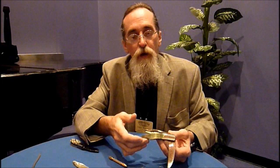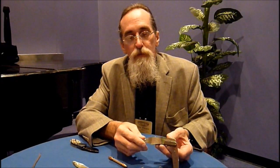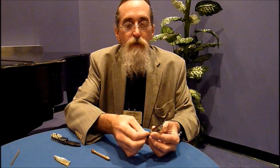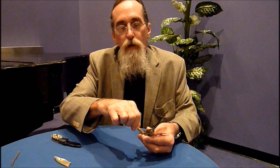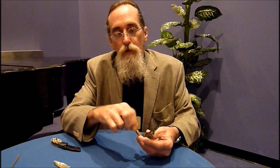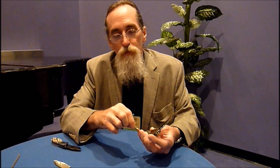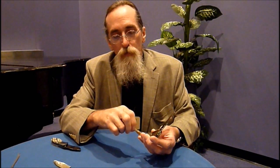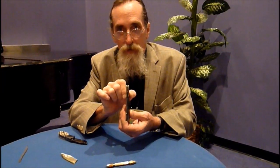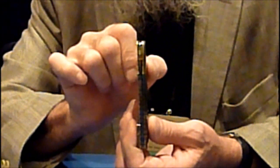Put the knife back together — you align the slots, rotate it around, lift it up until it hits the register pin. It's just a matter of tightening up the four screws. If the knife is built carefully with attention to everything being flat and square from the beginning, I just tighten these screws up. You look at my blade — it drops right back down in the middle of the channel again, right where I want it.